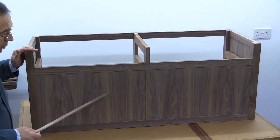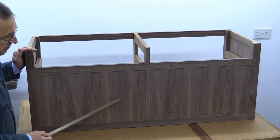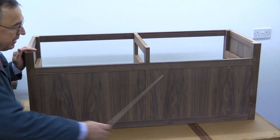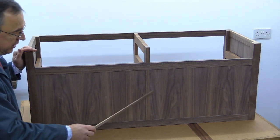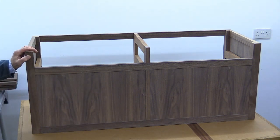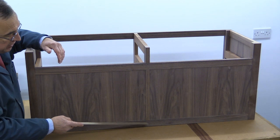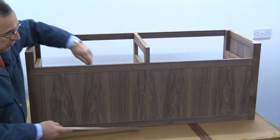The rear section consists of two separate panels of veneered MDF. There's a central stile which is rebated to take one panel on each side — going in about 6mm — with standard domino joints at the two ends. In the centre there's a rebate for the two rails, with a screw going in from the rear in each case.